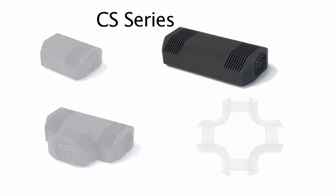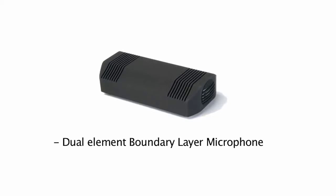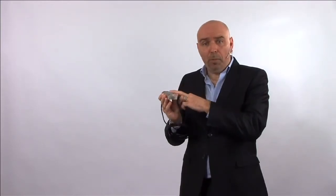The first microphone of that series was the CS2 RF. This is a dual element boundary layer microphone that enables you to pick up one to two participants on each side. It uses a multi-core cable, so two conductors per element and a common ground. The CS2 is usually positioned in the middle of a table that has a maximum width of about 5 feet. It's possible to use this microphone with a wider table, but that really depends on the acoustics or the critical distance of your room.